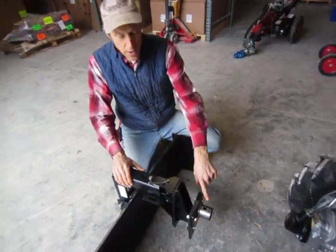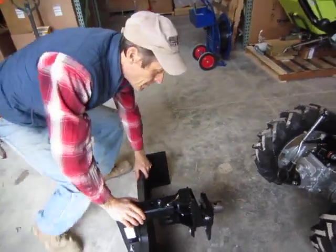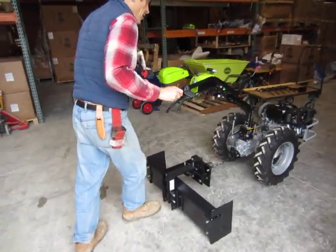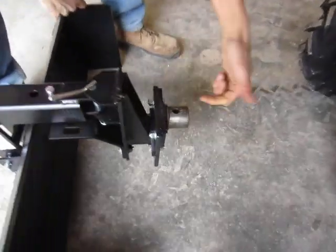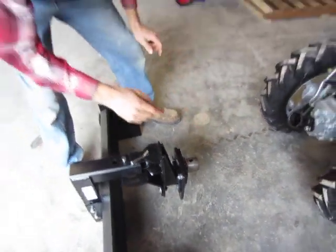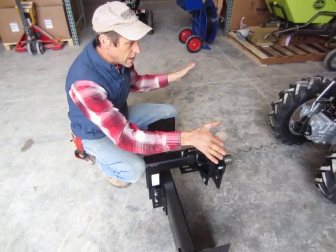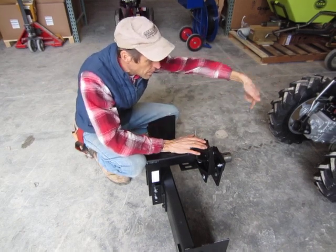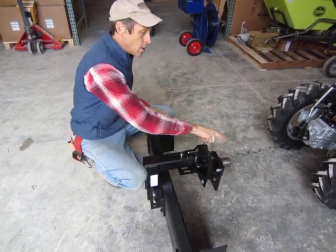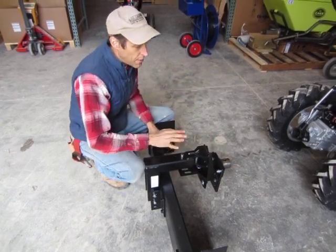We also installed a blank quick hitch to hook up to a quick coupling system. We offer blank quick couplings to fit BCS or Grillo tractors. On the blank quick couplings we produce, there's a hole on one side, and on the opposite side there's an ovalized slot — ovalized side to side. That gives you the choice of whether you want the implement to be rigid when it locks onto the tractor and you drop the quick coupling locking pin, or if you want the blade to float a little bit, you unbolt it, flip it over, and when the pin drops into the slot it gives you some sideways oscillation.